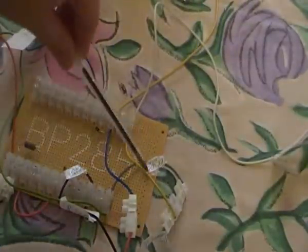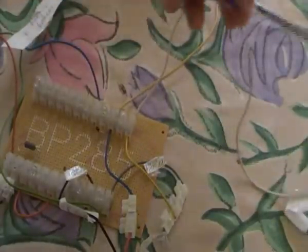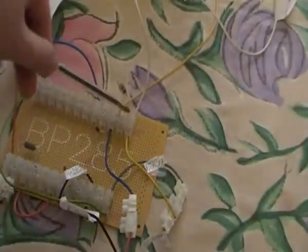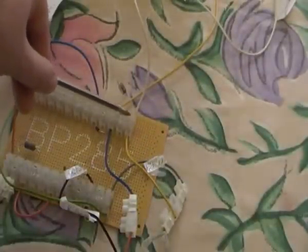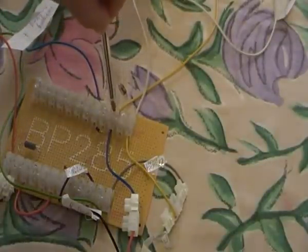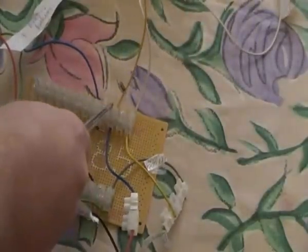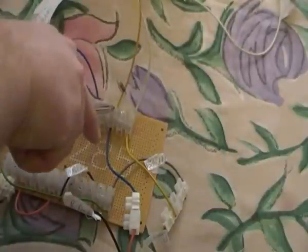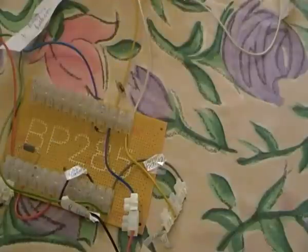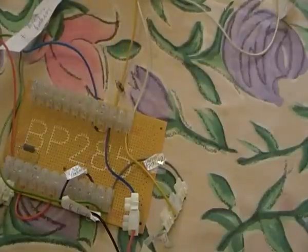This yellow cable is a cable from my emitter of my transistor. This white cable is going to be connected to the minus of the start battery. This is my lamp — this cable is connected to the one side of my lamp. The other side of my lamp is connected to the collector, and the yellow cable going from this connection points directly to the bottom of the 23 power coil. So it's my second cable which I connect to the bottom of my power coil.